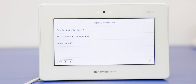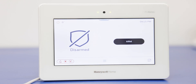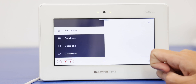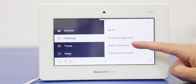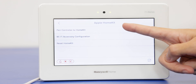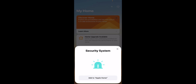Now we're going to start the pairing process. In the HomeKit app, you'll see the Add Accessory option. It's going to pull up your camera to find the QR code. To get the QR code from the panel, go to the menu icon, back to Settings, then into Apple HomeKit. Enter the installer code 4-1-1-2. The first option you'll see is Pair Controller to HomeKit — that gives you the QR code, which we're going to scan. Perfect, it picked it up right away. We're going to press Add to Apple Home.